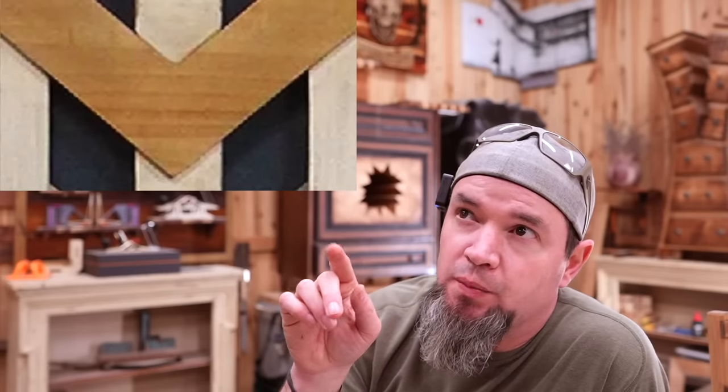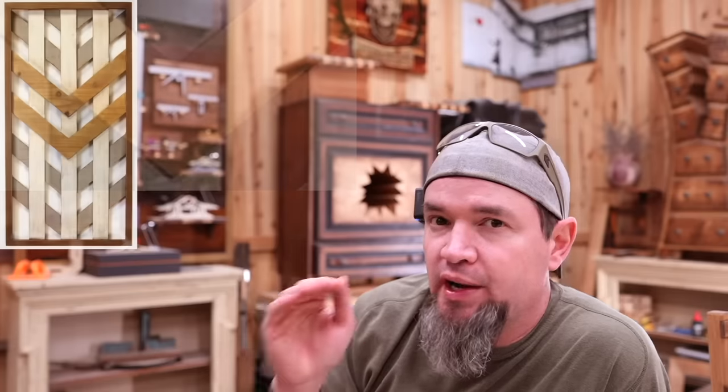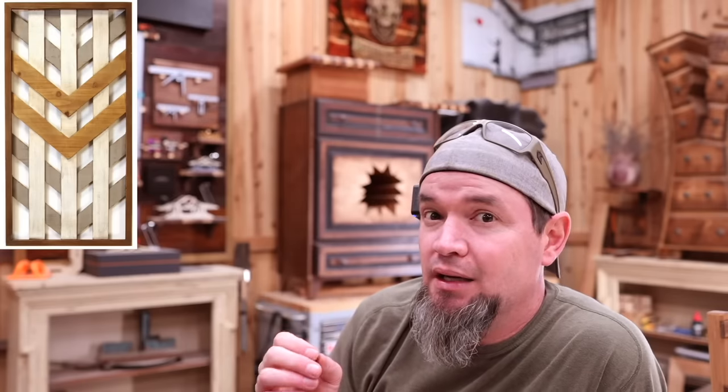This first one is an example of wall art. Is it $206.99 cool? This is from Wayfair — I'll just call it WF — and they're calling this geometric wall art. What they're doing is layering different color strips: long strips going down the center and then arrows made of 45-degree angles. That's the only angle you'd have to cut. And if you zoom in, there are no seams and the grain is going the same direction — so this is cut out of plywood.